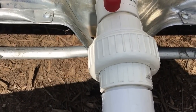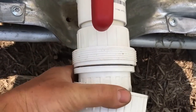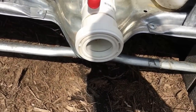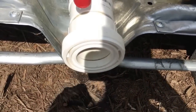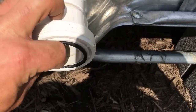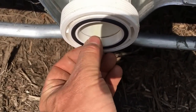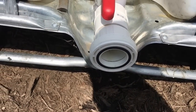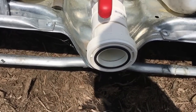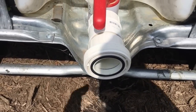Along the lines of lessons learned — when you're purchasing equipment, this quick disconnect is used for draining water and moving pipes around and saves a lot of time. One thing I've found, and it's happened to me several times at Lowe's and Home Depot, is you'll get one just like this and it's missing an o-ring so it will leak like a sieve. You have to open up each one you get and make sure you have that little rubber o-ring right here — it fits right in here. If it's not in place, find another one. I'm 45 minutes one-way from the store, so that mistake costs a lot of time on a project.